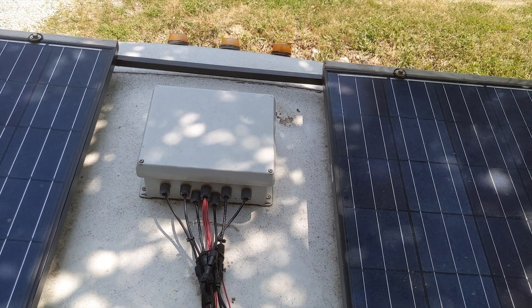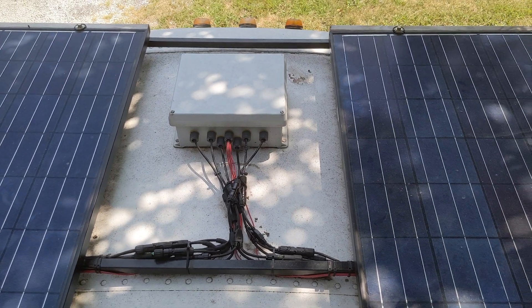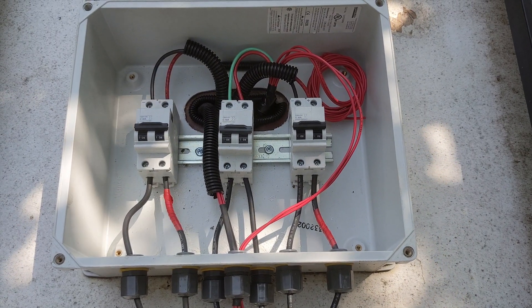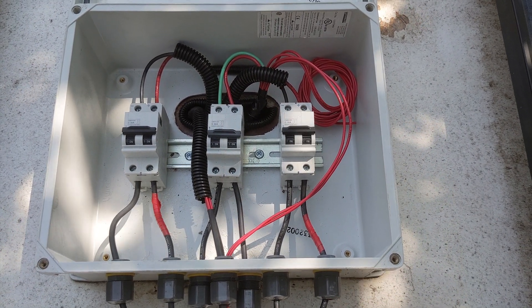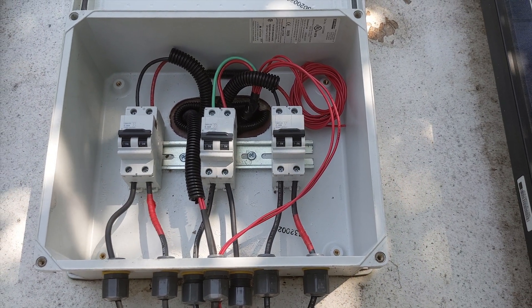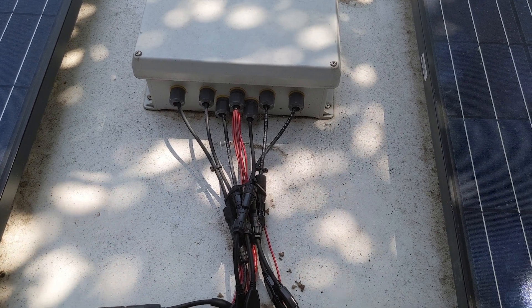Because the hole was already through the roof, I figured I would use it — I didn't want to vent out my heat and cool. My charge controllers were maxed out, so I added a third system just the other day. I just got it done. Everything's working good. As you can see, there's six black wires — that's two wires per system.